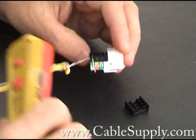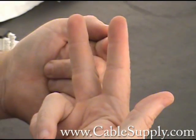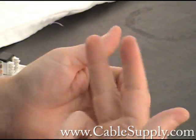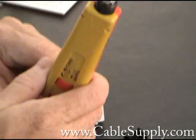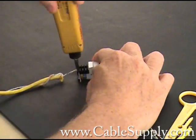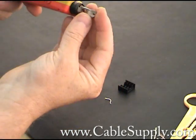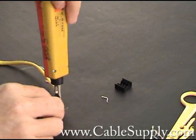Once you put the wires in the slots — there are little metal things in there, sort of like a V — the wire gets pushed down with the punch down tool and cut off right here. As it gets pushed down, these two metal pieces will actually strip away the insulation and attach it. I'm going to take my 110 punch down blade right there. You'll notice it cut cleanly because I used the cut side — you can see the cut side on the 110. Now I'm going to punch down the other side.